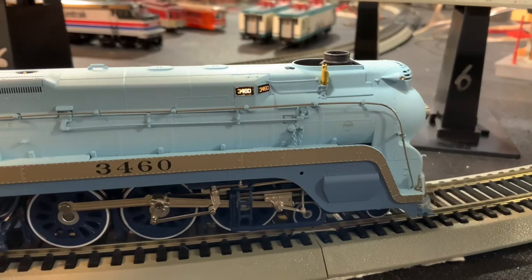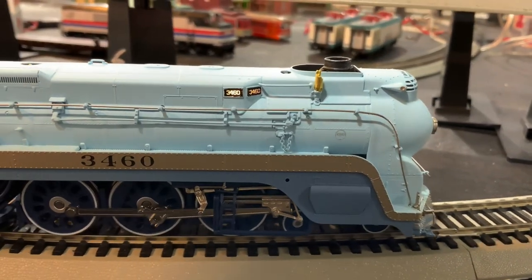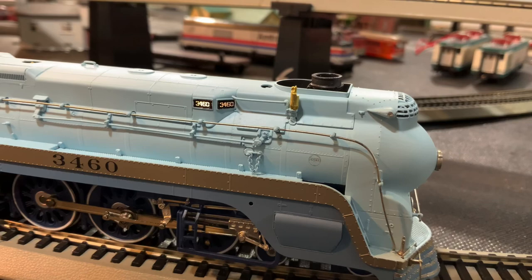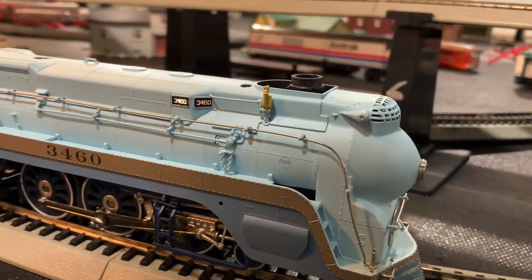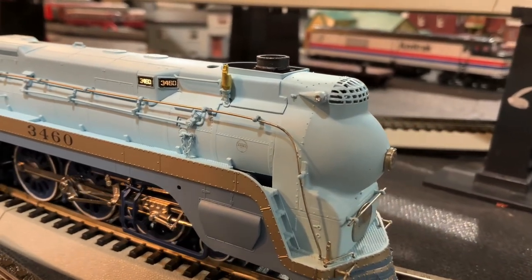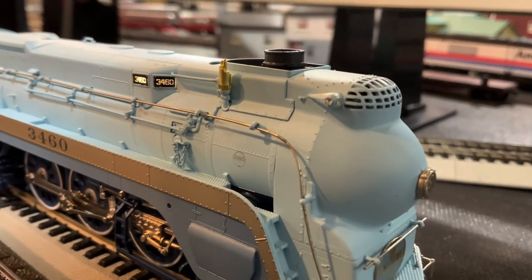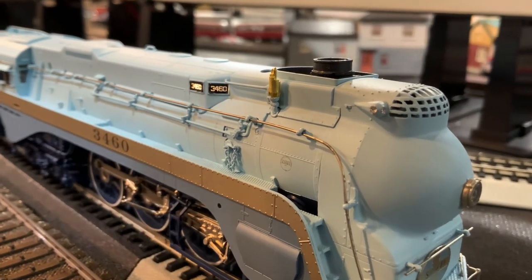There is a fundamental flaw in this locomotive. And I proved in my previous video that the electrical pickups in the front can completely stop working. What's kind of interesting though, is if you run this thing backwards, it'll have the problem a very little bit, but it won't. So, scratching my head thinking what could be the problem, I'm going to run this forward to the point where it goes onto the capacitor because it's not picking up power.